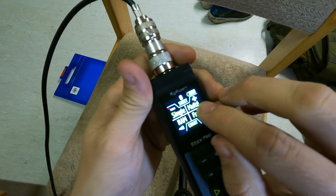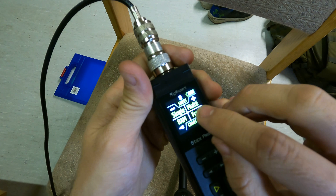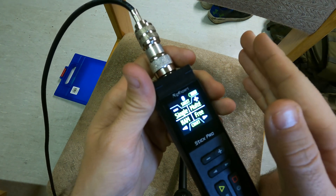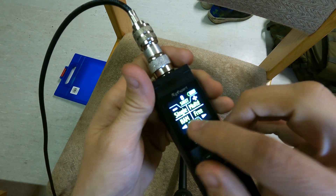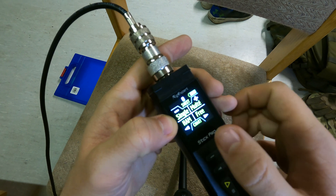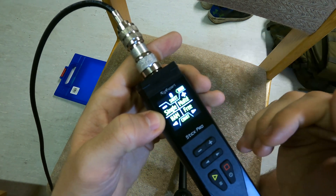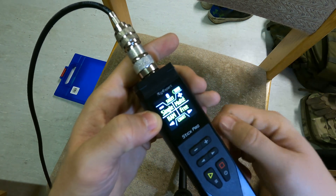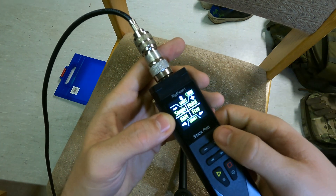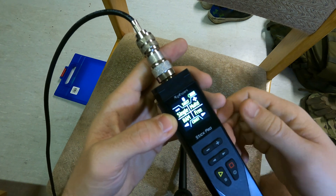Overall summary of the main page: Multi and Ham are essentially the same thing, except Multi gets rid of all ham bands that aren't applicable at the current moment based on SWR. Single just lets you look at the SWR — and whatever other parameters you want. And Free is just kind of free-roaming, not scoped in. I personally like the multi-band mode quite significantly.